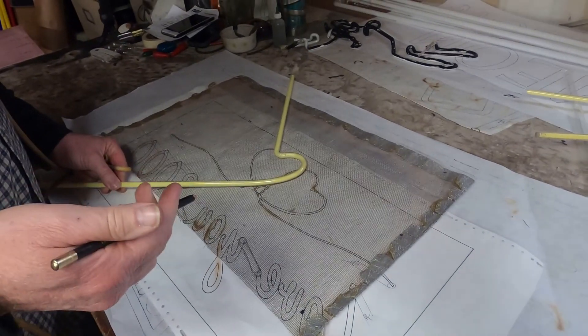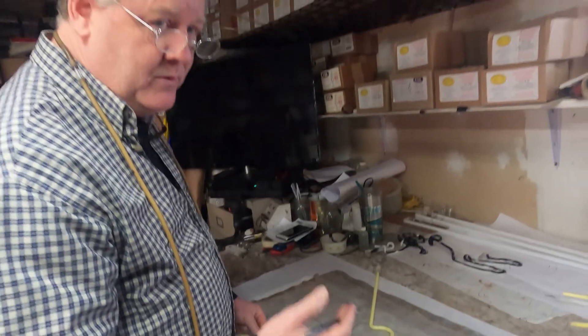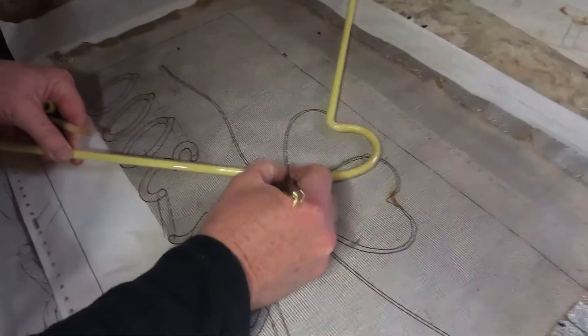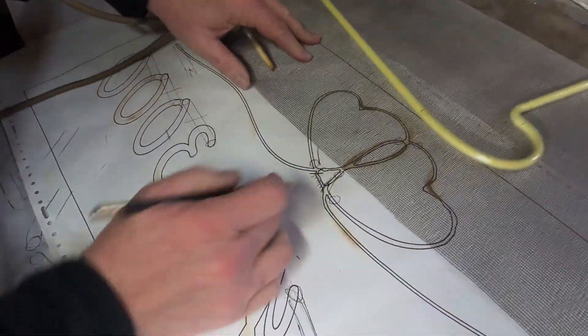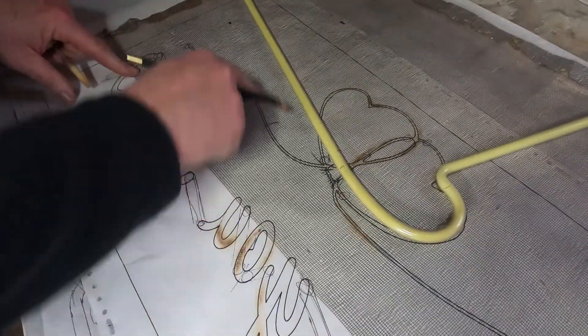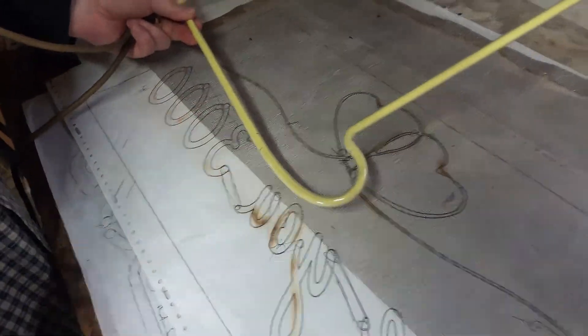One of the things we use when we're bending neon is some type of an item to mark the glass where we want to heat up, because you don't want to heat up everything at one time. So I'm going to heat up starting about there and then come over here and heat it up there. On paper, I'm only heating up this much area. Then we'll come back and do this one after the fact, so right now we're just going to bend this one little section.